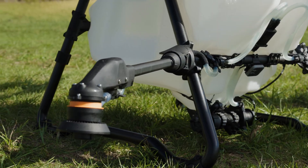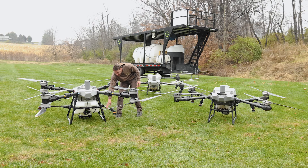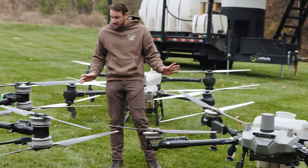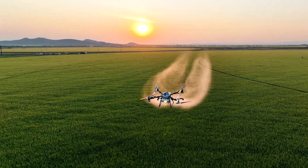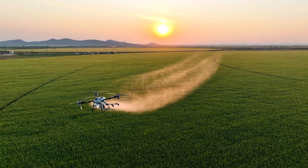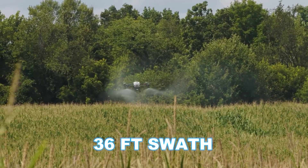One nice thing about the T100 is the spray lances are not connected to the arms of your drone anymore — they're just little booms you can easily open and close. On the T60X and the T50, those are attached to the actual arm of the drone. Not a huge change there, but the swath on the T100 — current data shows a 42-foot swath with two- to three-gallon work. That's impressive. The T60X swath is closer to 36 feet compared to 42.